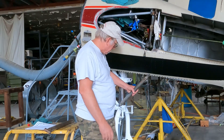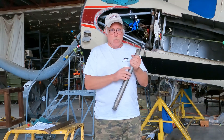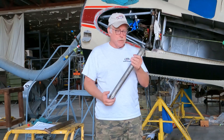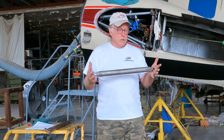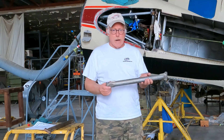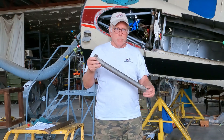What we're talking about is the drag leg that goes from the landing gear up to the slide trolley on your slide. This is what we have here — it's a welded unit. This used to have white paint on it about a day ago. We've got it completely stripped and brought it to the NDI shop. What SI 1183 wants you to do is mag particle inspect the outside, check for any physical or structural cracks, and then do a four-shot x-ray to check for internal corrosion.